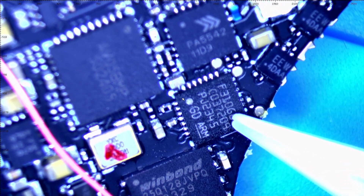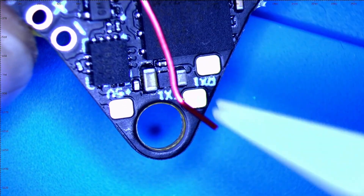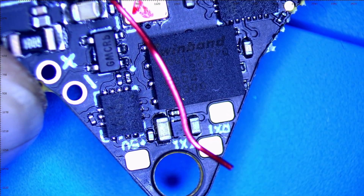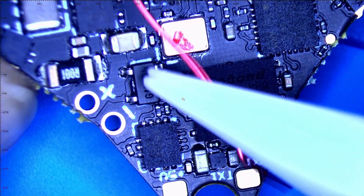Moving right along, we've got an ARM chip right here. This is actually an MCU — this is a GD32F310. It's an onboard MCU chip. In the bottom left-hand corner you've got an RX, TX, and five volt. You've got your ICM 42688P — that's your gyro. That's an awesome gyro to have on such a tiny board. And then you've got your current sensor right here.